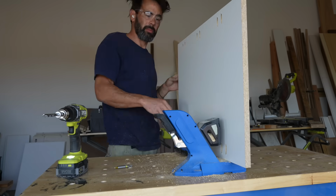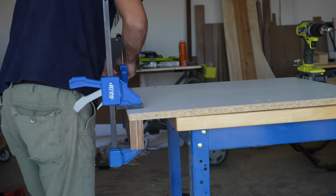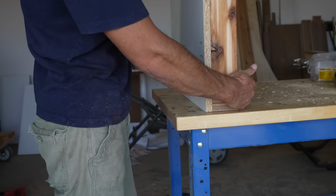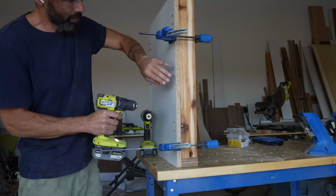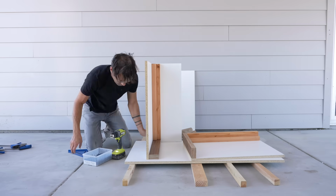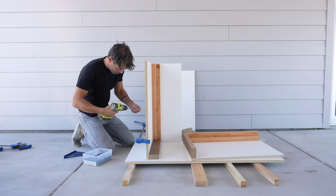The walls of the mold are made out of 3/4 inch melamine, and I used 2 layers of 3/4 inch plywood to make the indentation that the desktop will notch into. I'm trying to get rid of scrap, so I just picked the pieces that I had on hand, since I try to minimize using new material for concrete molds.